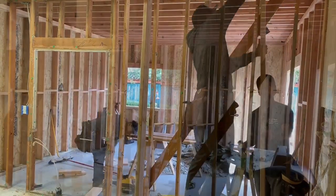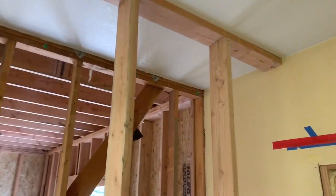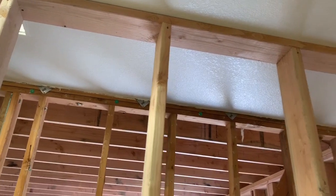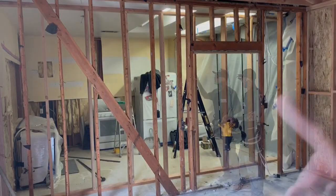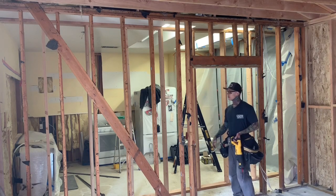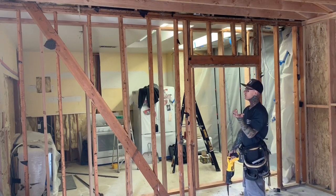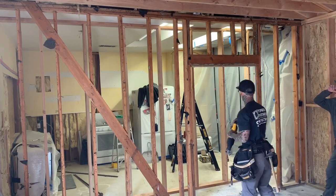You can see I have the top plate and the studs, with metal clips on the existing wall — that's where the trusses run perpendicular — and there's a stud on every single one. All we're doing is building a temporary wall back about three feet so we can take out the existing walls. With a stud on each truss, I can remove the existing wall and nothing's going to happen. We already eliminated the electrical we could; the rest will be cut and moved for the electrician. Once we put the beam in and reframe it, we can remove the whole temp wall and this room will suddenly be open to the old kitchen.